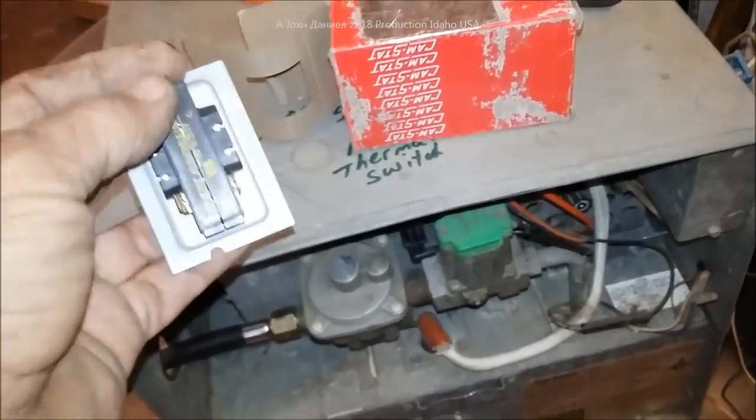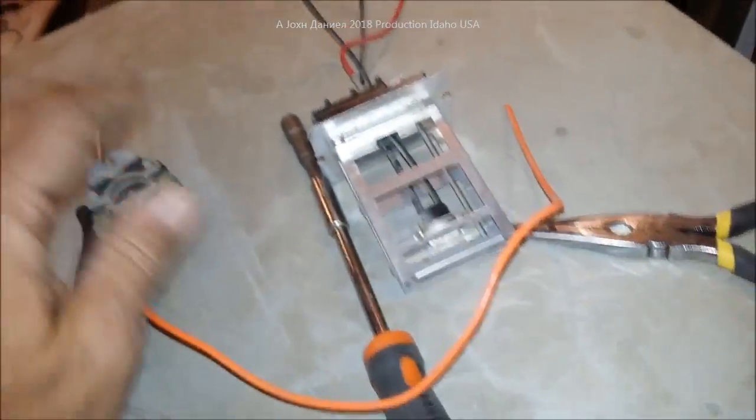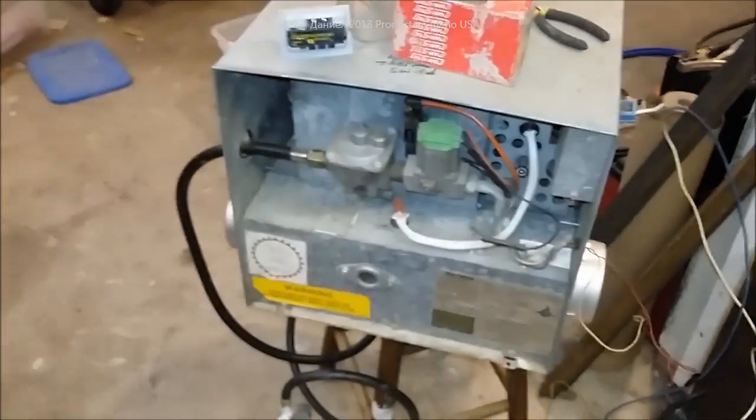what we're going to do is change it out. I'll show you what this one does and how to properly hook it up — it's not much different than if you're mounting it surface-mounted in the air handler. So we're going to go ahead and disconnect, pull the wires apart, and leave the gas on — there's no reason to take it loose — but you want to kill power to it. In my case I'll pull power from it and leave the clip hanging over here.